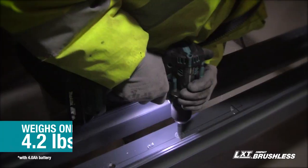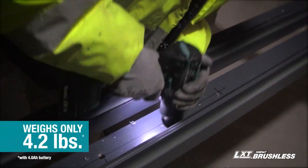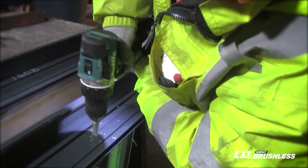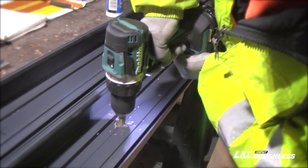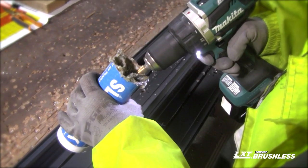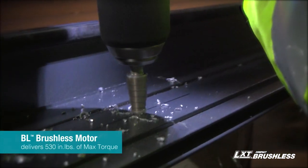These are window headers — we put them up and they have to be pre-drilled so that when the guys go up to put them up they can just put the bolts in and go. On a daily basis we have to mark exactly where the holes are going to be drilled. I put my half-inch unibit on, grease it up with my slick stick, and proceed to drill about a thousand holes a day.